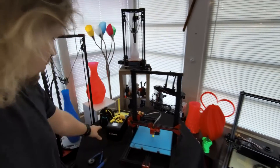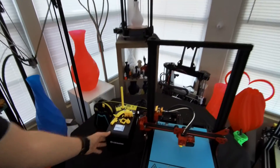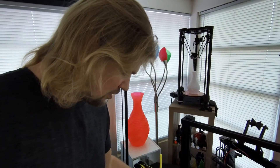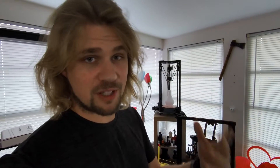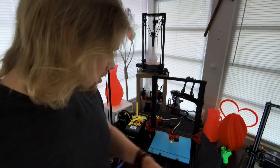The only thing I had to do, other than get it out of the box and plug it in, was switch it to 110 volts here in America. You also have to connect the plug-ins for the motors. If you can't remember which motor is X and which is Y, the motor going back and forth is the X motor, and the other is the Y motor. You just look for the extruder — the extruder cable always has the proper motor next to it, which is the X motor. Once you get those cables ready, you can start test printing.